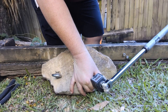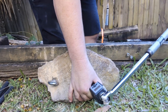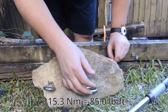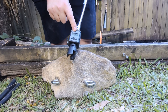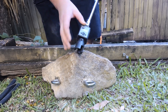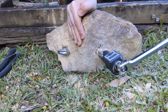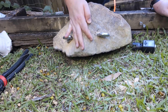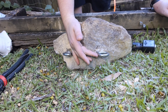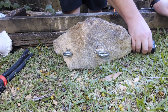Okay let's try this one. So that's gotten to 115 and it was rotating the bolt — the beeping is set to 120 for my car bolts, and it didn't quite get to 120, got to 115.3. I don't know if you can see it but it actually did bend or twist slightly. So if we want 150 newton meters without moving the bolts, I guess that's failed. Still didn't break or anything though.